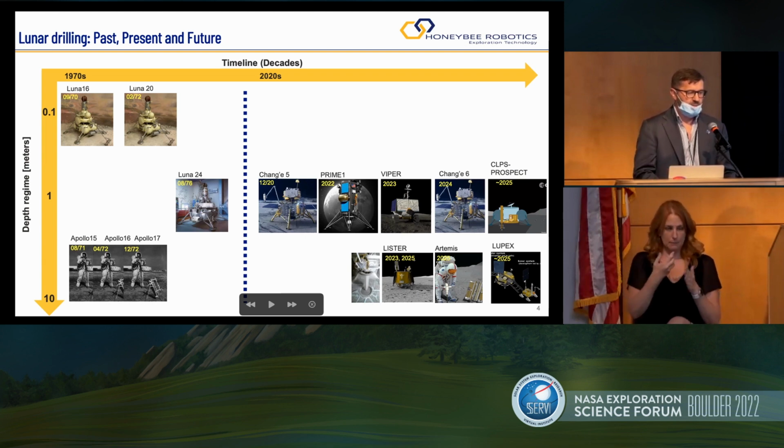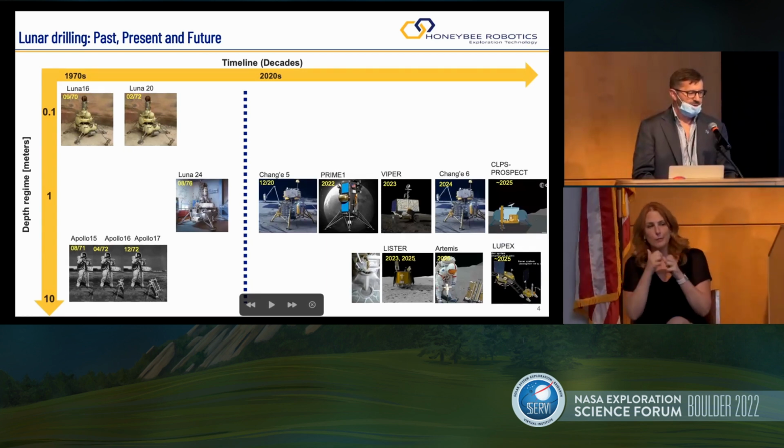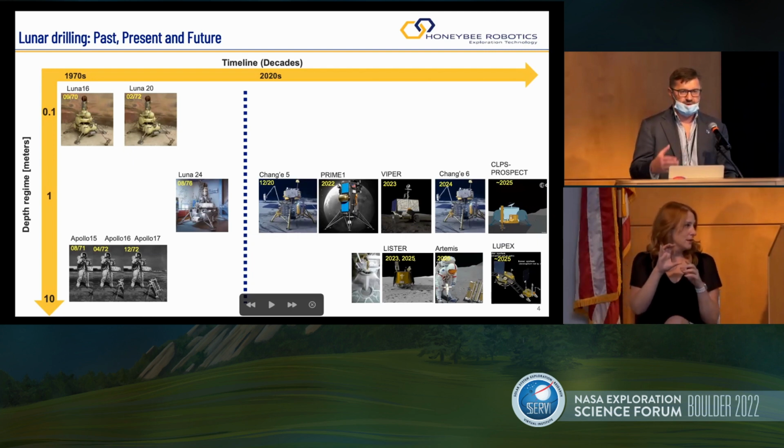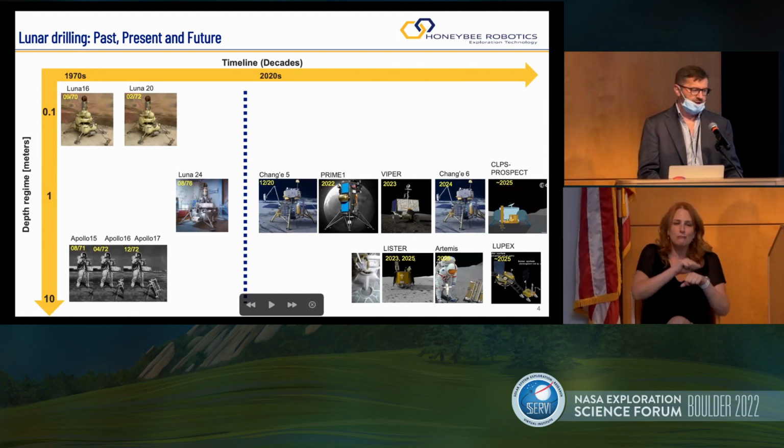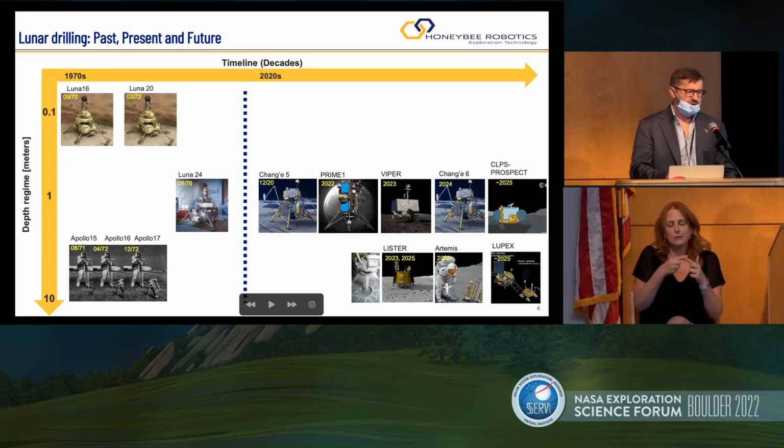Since then, nothing really happened. The next one was Chang'e 5 in December of 2020. It used pretty much exactly the same approach that Luna 20 used in '72. So this shows that if you've done something right, other folks will follow and use this technology, and that's what happened with Chang'e 5. The purpose was to drill down to 2 meters. However, the drill stopped at 1 meter depth. It hit a rock. It didn't have enough power to percuss, and the samples were returned from 1 meter depth.